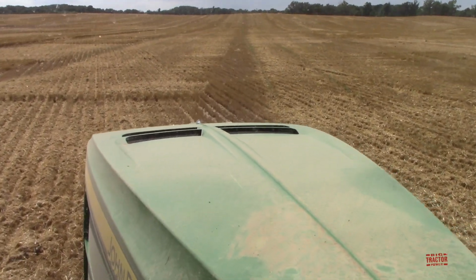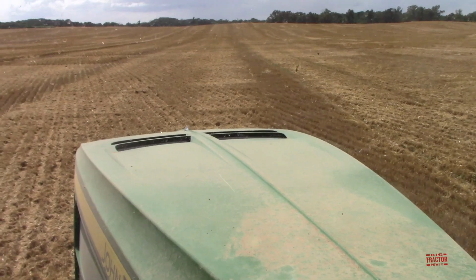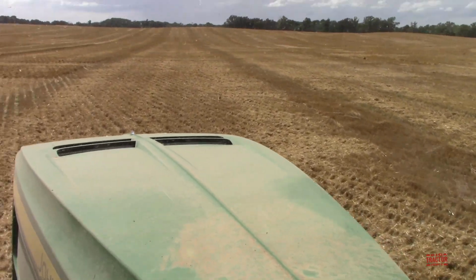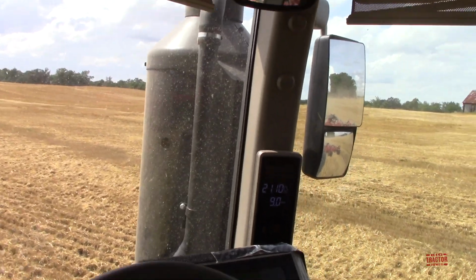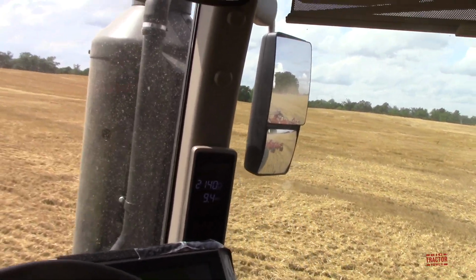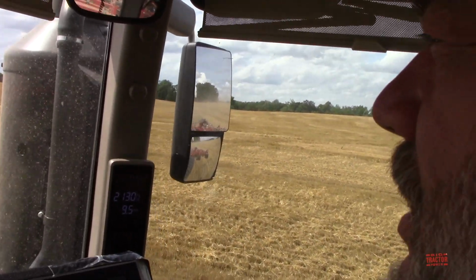Then we can also see from the wheat stubble out there, this same seeder was used to plant the winter wheat, and we kind of see that ribbon seeding effect. That's a 15-inch row ribbon there, though. So what do you do? I noticed when I'm out in the field looking at this, you kind of have all the seeding on the right-hand side, and then on the left-hand side, it's in the back, or switched around. That spaces it on 30-inch spacings when you do that.